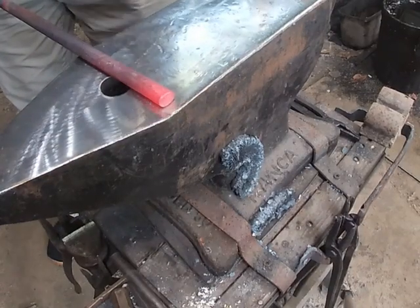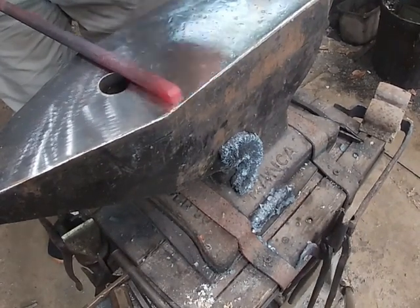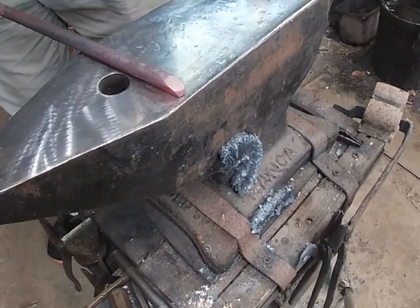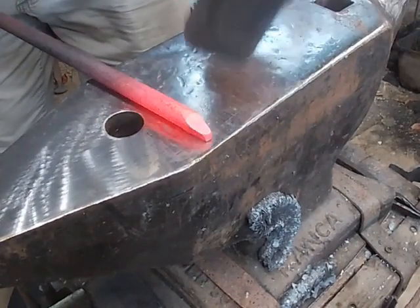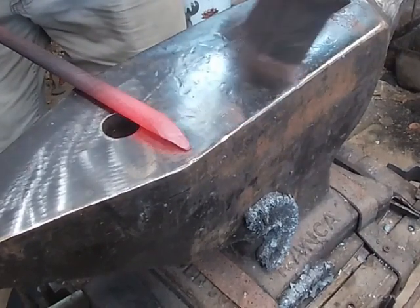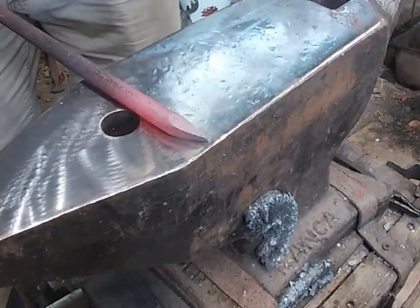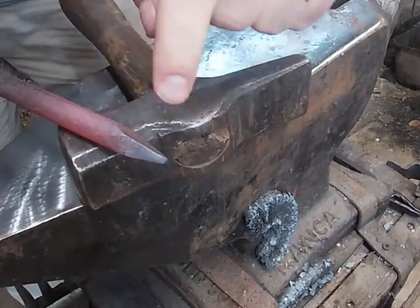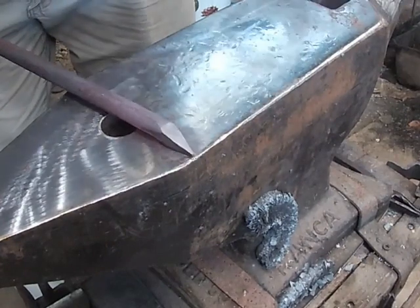The first thing I'm doing is drawing this out into a blunt point. I'm not going super sharp on it, just drawing this out into a good blunt point. I'm working the two sides and drawing this out super far. I'm working it to make this right here a little bit more pronounced in the center, because that's where the wideness of our leaf will be.